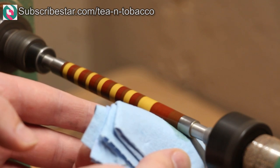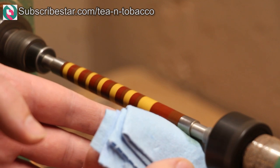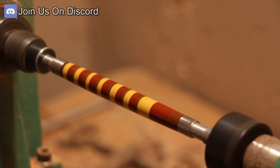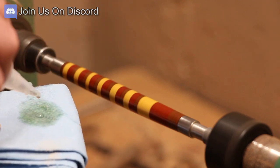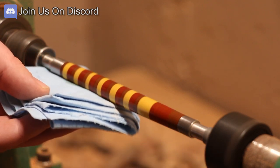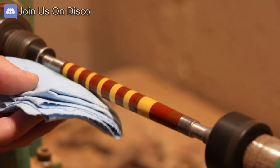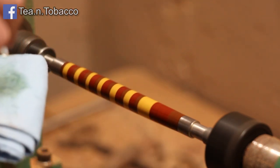Here I'm just applying the boiled linseed oil, and then right on top of where I had the boiled linseed oil — I'm using a shop paper towel so it's not going to get caught up and pull my hand in — I'll put the super glue right on top of where the boiled linseed oil was. This kind of acts as a bit of a catalyst but also a lubricant, so it spreads nice and even. For the most part, I don't even have to bother sanding with this finish afterwards because it looks really good by itself.